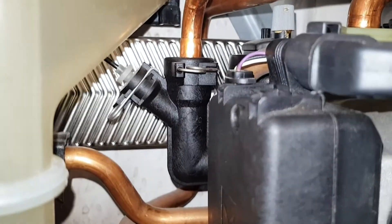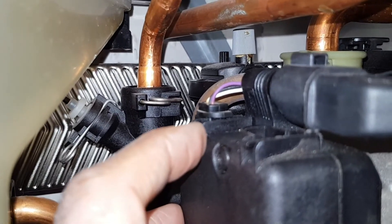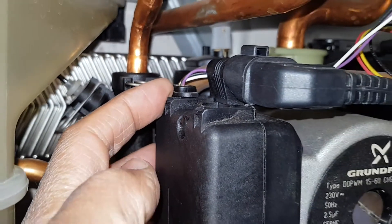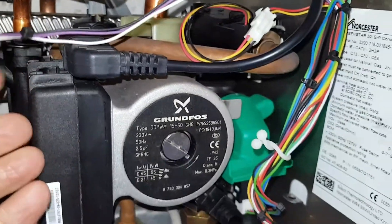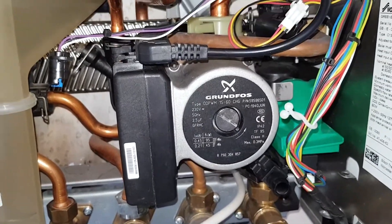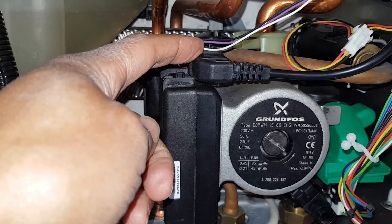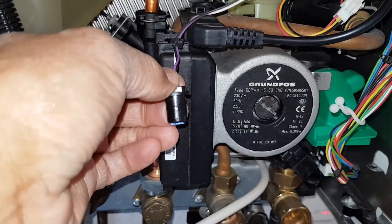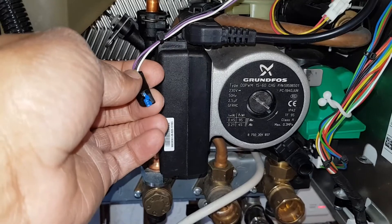So I carried out a couple of tests which I'm going to show you — how to test the pump if it's working properly. This is the side of the pump and you can see these three wires here. I've removed the little stop that goes there and I'm going to pull this plug out of the pump. So I've pulled it out like that. What should happen now is this pump should start running, because this pump has a permanent 230-volt supply on it 24/7, and these wires control it — telling it to start at full speed or to slow down. By pulling this plug out, it should have started the pump.